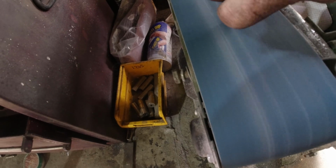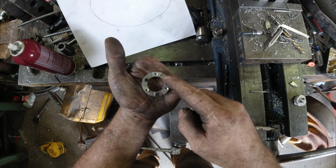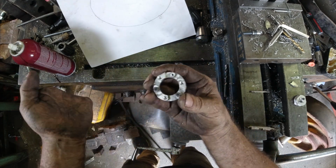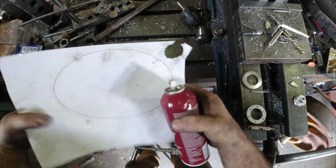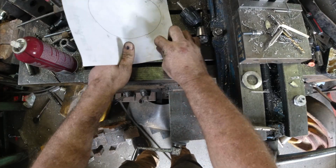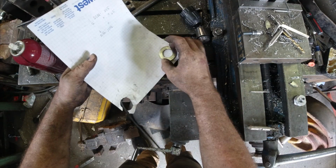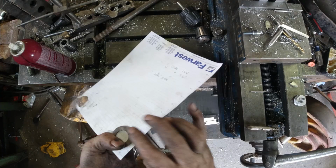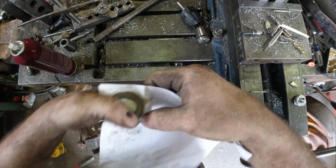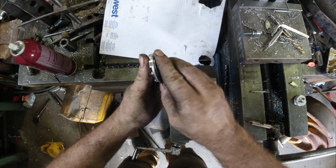After the cleats are done and turned freely in the aluminum base piece, now we need to drill the holes on the cap pieces. For that, I use a piece of paper and some 3M77 spray adhesive. First, I lightly coat the corner of a piece of paper. Then I place the aluminum piece. Next, I spray the other side of the piece of paper and align the stainless part with the aluminum piece. Then I tear the parts from the paper and repeat the process for the other pieces.